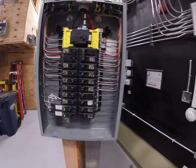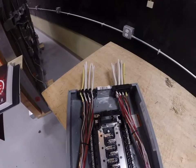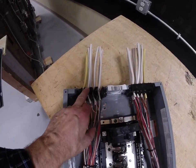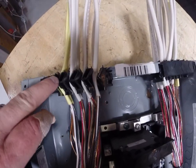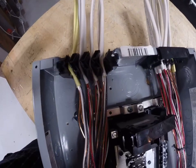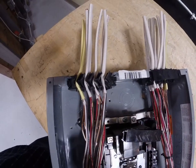Now, after this panel, Square D — quite a while ago they came up with this style, so it's been around for a while. Basically what this is, is there's this insert, and you strip the cables, you slide them in — no Romex connectors needed, no lock nuts. Sometimes people mess around with lock nuts and kind of fumble around with them trying to get the lock nut on.